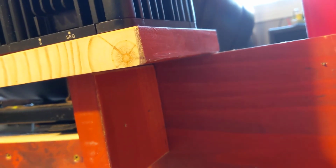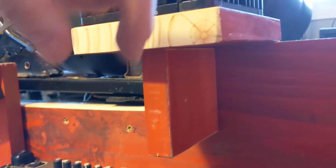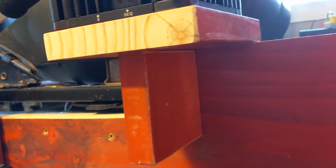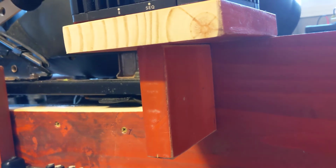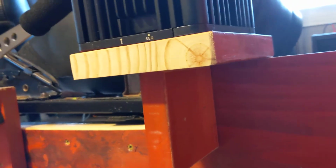It could be fun to mount one here. In general though, they should be mounted on the horizontal plane, because the piston has to go up and down, and if it's off center, it creates friction, so it's less efficient, but that's a good way to burn them out too, I think. The documentation does say to mount them so that the piston is in the vertical.